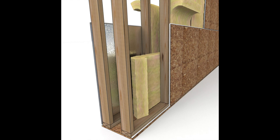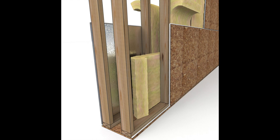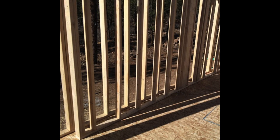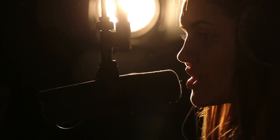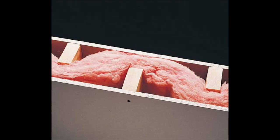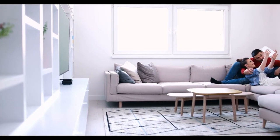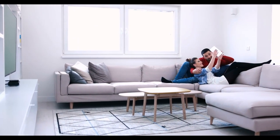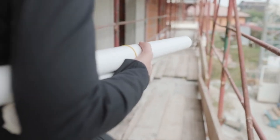So which option is the ultimate choice? For people who want the ultimate type of soundproofing, double stud walls are the way to go. It will provide superior soundproofing and most people will use this professional setup if they are building a room specifically for recording or even a home theater. For more traditional soundproofing, staggered stud might have the advantage a person is looking for — it will not provide the same amount of soundproofing, but the construction takes up a lot less space. Not everyone has the luxury of using up more than a foot more of space on each wall, and in fact there are some locations where building code will not even allow double stud construction. It is always advised to check with local building codes first.